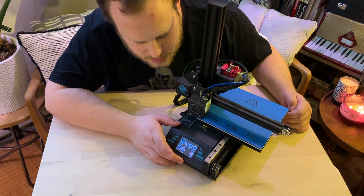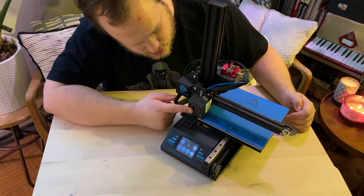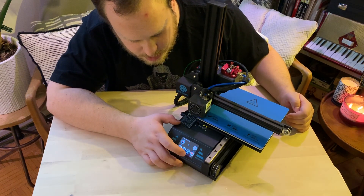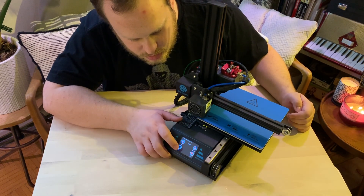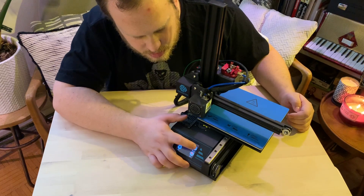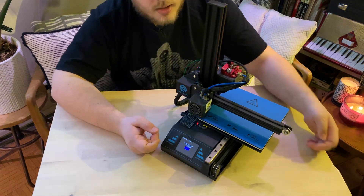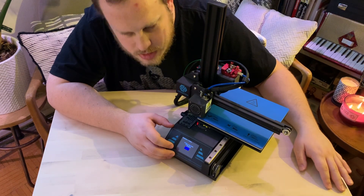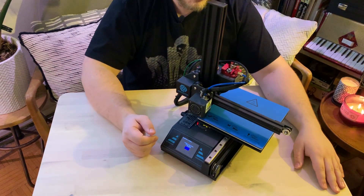There are language options, which I'm going to keep to English. There's fan — you can adjust the fan speed, so we can do 100% for the blower fan on the extruder. It starts picking up. You can do 50% and then 0%. There's also filament change where you can load or unload. We're going to click the extruder option and click unload. It's going to heat up and give you a little message. We'll do a bit of a time lapse here while this heats up, and I'll show you how to do the full unload and then reload.